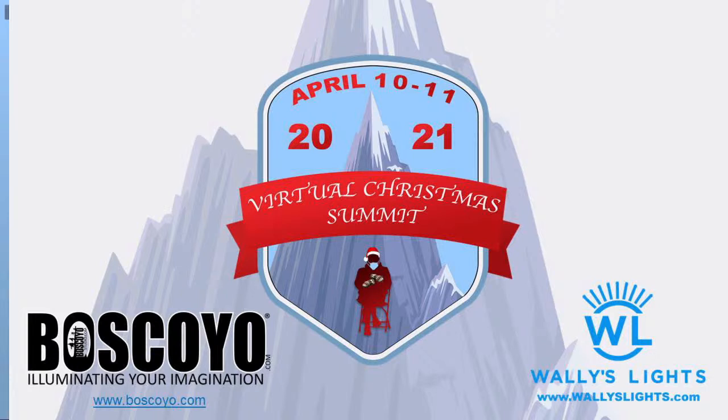Current versus intensity. An LED will actually produce about 90 to 95% of its maximum intensity at about 75% of the maximum forward current. And even at half the maximum forward current, they're still putting out about 75% of the light. And the human eye, which looks at contrast, finds that much more pronounced. So again, running at half current puts out three-quarters as much light and uses half as much power. The important thing is that it makes them last a lot longer.